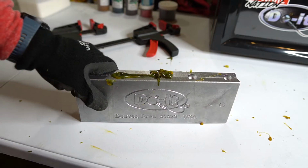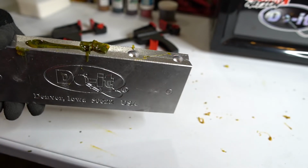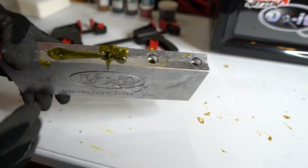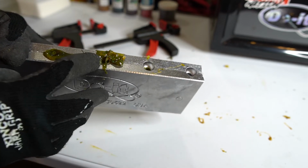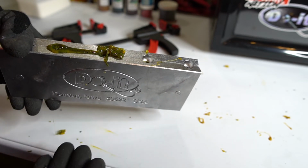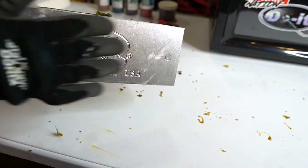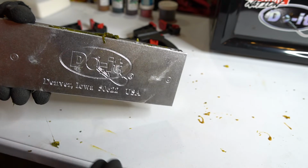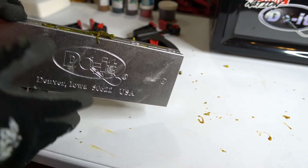So honestly, one of the nicer things about this mold is even though I didn't get a very good pour, I didn't get a very good clean injector full of plastic, because they're individual cavities, I only had to shoot 2 of those cavities for it to turn out well. Had you been doing this on a regular mold where it's a single injection and it does multiple baits, you're going to end up wasting a lot of plastic because a lot of the baits are going to be half full, or you're not going to have a full injector and you're going to have some issues.